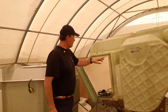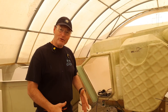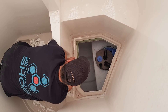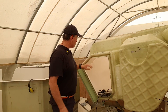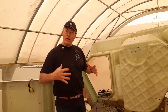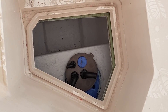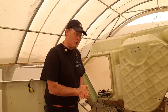The second thing I need to do is trim and tidy up the edge of this access hatch down into the blackwater, freshwater and bilge section. It's quite sharp — not a very nice edge — and I'd hate to reach my arm in and gash myself. I also intend to reinforce this as well because this is essentially the structure holding the head and the shower in place. When you're in the shower, you're physically standing on a lid that sits over this lip, and that recess is in fact the drain down into the greywater or blackwater tank.